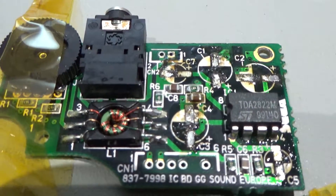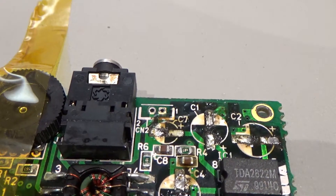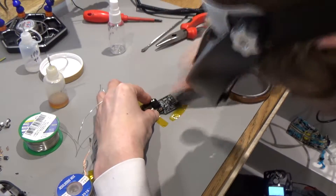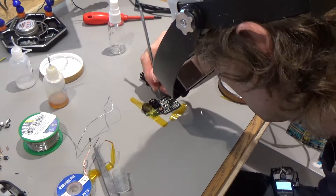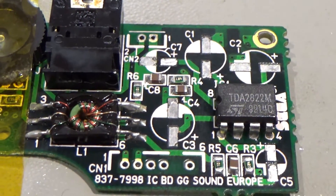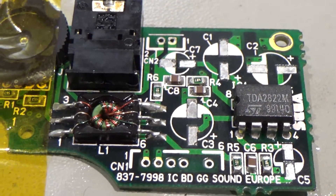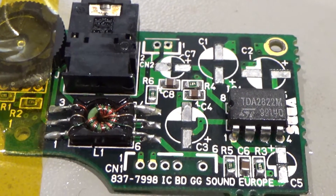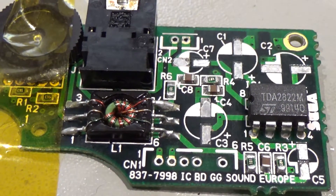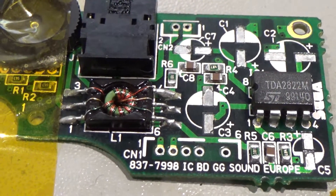All the pads are cleaned up. We just need to clean all the flux residue off, but they look quite good — they're reasonably flat, just a bit messy because of the flux residue. I'll clean all that off and see what it looks like. There we go, not too bad. Those pads have cleaned up really nice, so we're ready to put fresh capacitors on all of those now. I haven't damaged anything, not lifted any pads, and everything just looks almost brand new. The corrosion from the capacitors hasn't really damaged anything as far as I can see.